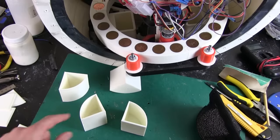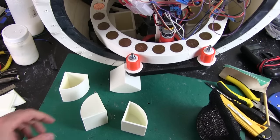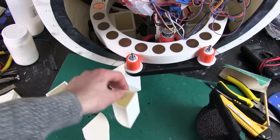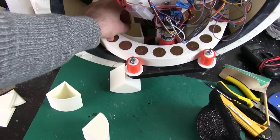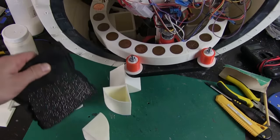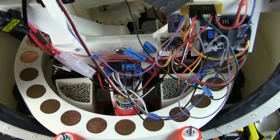I've made these containers to put the lead shot in and also made lids which I can seal on the top — those should fit pretty well, keeping the lead shot from spilling out. The plan is to stick them in just here; they can go fairly low down. I'll solvent weld those onto the existing ABS with acetone and distribute the lead shot evenly among them. Lead shot is installed into all four containers, and I'm going to solvent weld the lids on before testing, so in case it tips over it doesn't all spill out into the ball.